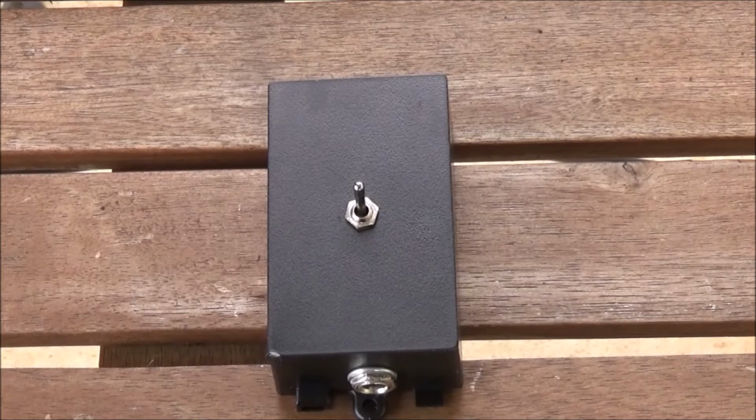The second part that I made was the switch. It has been designed to take 12 volt power from any source that has a 2.5mm DC power line female connector. The switch itself only has 4 components: a plastic bulkhead mount case, 2 2.5mm bulkhead male DC power connectors, one for accepting power in and the other for power out to the pump, and a mini toggle switch. I bought all these components from Jaycar.